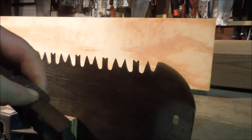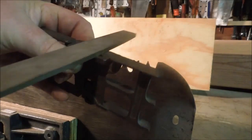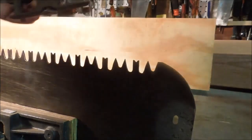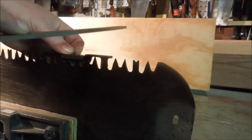This plate on this gauge is hardened so the file just slides across it and doesn't cut. That way you can go across and dress all these teeth down and not wear out your gauge.